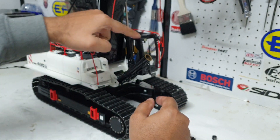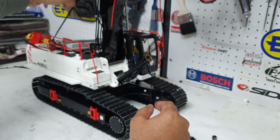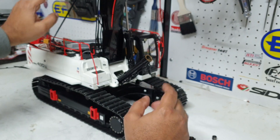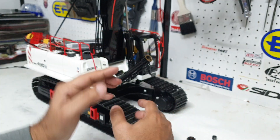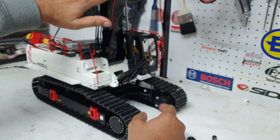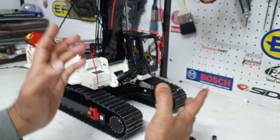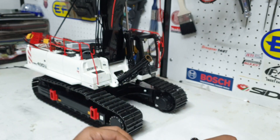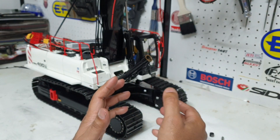If you're going to do one cylinder and you think you don't need to put the cord in, what's going to happen is the oil from this cylinder is going to travel and come out and create a mess, because both cylinders are equalized in pressure. So it's very important to secure the main boom first. Once the boom is secured, take one cylinder at a time, do your repairs, put it back, and then go for the second cylinder. That's the easiest way — then you're not having mess everywhere.